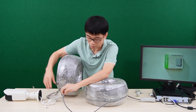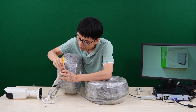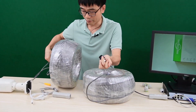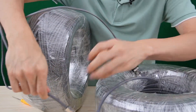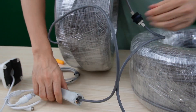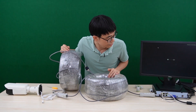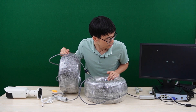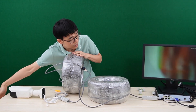Now let me disconnect the current setup. Connect the coupler, then find one end of the new cable section and connect it, adding the end to the second PoE extender. Let's wait for a moment because the camera needs to reboot before we can see the live video on the monitor. Let's see — okay, we are seeing the live video now.